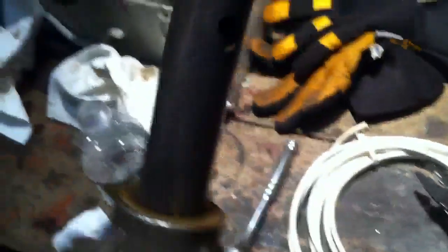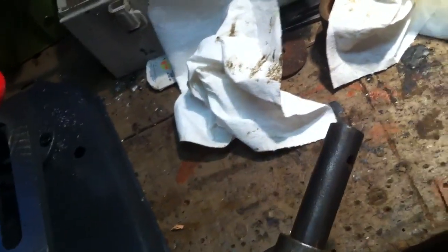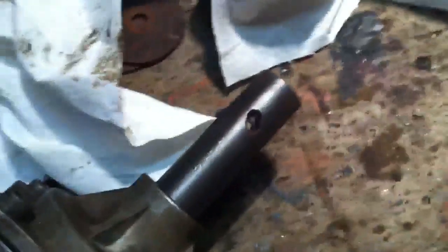It's really clean — there's almost no rust. There was some rust on this shaft here. I cleaned this up with a wire wheel because there was some rust on it. What happened here was the shear pin. I went to go take the auger rake off and this was an old auger rake, and the shear pin was seized in there. I was banging on it with a hammer and it would not budge. So I tried turning the other end of it with a ratchet and the head snaps right off. So I drilled this thing out — not the best drilling, but this hole is only that big so it's not that big of a deal.